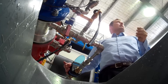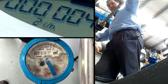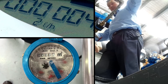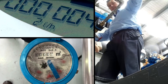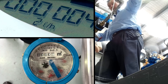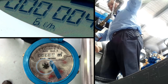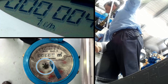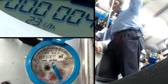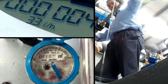One of the great things about the iPearl smart water meter is the ability to record extremely low flows. We're currently running about two litres an hour, seen on the drip — there's a visual indicator. I'll increase the flow until you see the bar water meter start to work. So currently running between one and two; we increase the flow now, slowly increasing with the needle valve. The bar meter has just started to work.